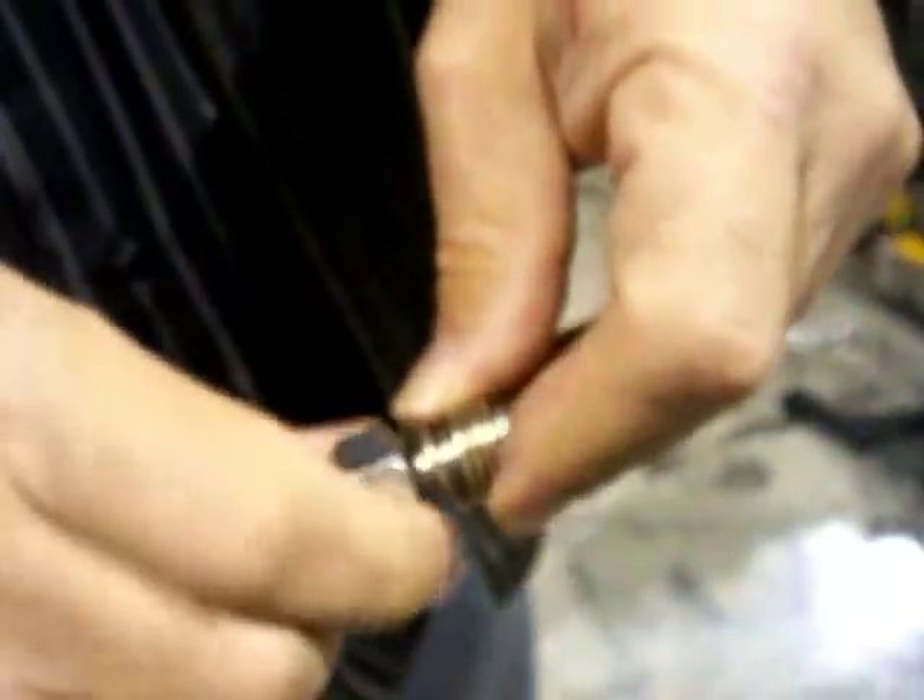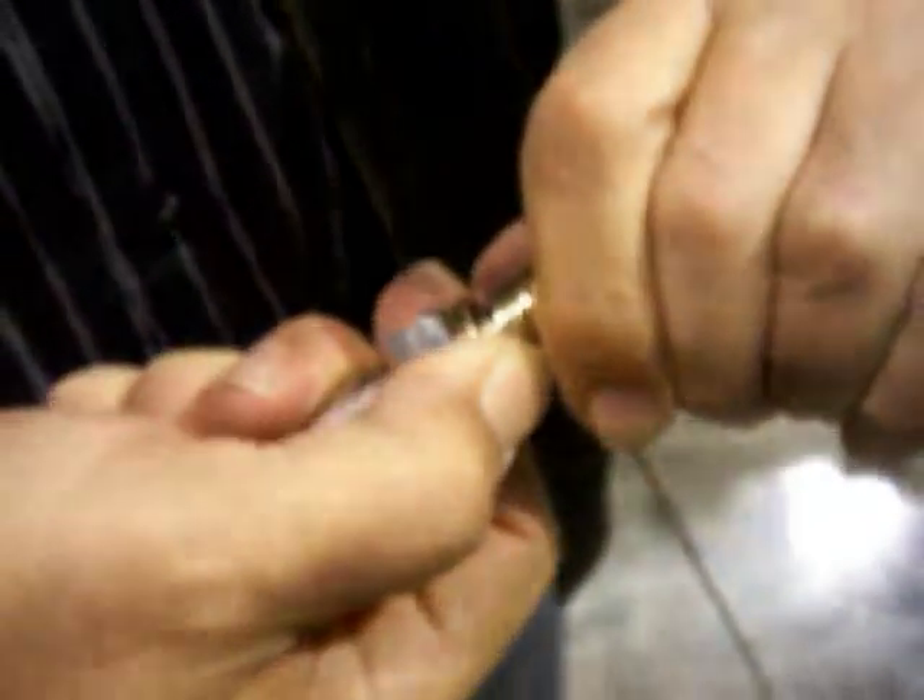In this particular case I'm not even sure what it was — just some silver braze that was unidentified — but I've used it before and I know it melts at roughly 1,100 to 1,200 degrees, and it works good with the white Harris Stay-Silv flux.